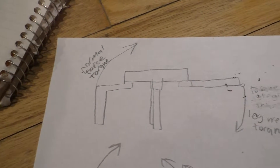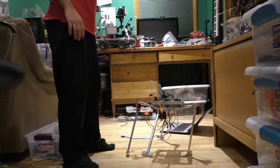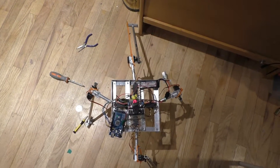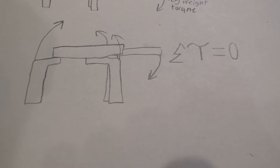The other thing that arose throughout the whole process of designing the code and the parts for the robot was I had to account a lot for torque and the shift in equilibrium. Whenever one of the legs lifted up, the other two had to go forward in order to put the torque's force on the other side of the center of mass, so that they could counteract the new force that's acting in the other direction.